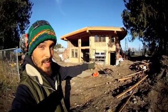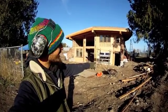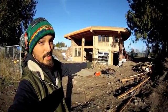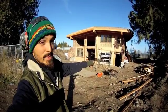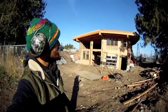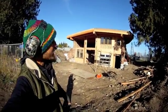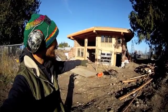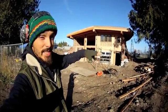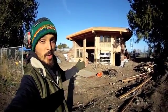And we're using the good old-fashioned Nader Khalili-invented super adobe white poly bags there at the bottom. That's for holding gravel, creating our foundation. The roof is going to be an eco roof, and we're building a berm around the back of the building here to actually retain heat. It's an earth battery, which will help heat the home through the winters.